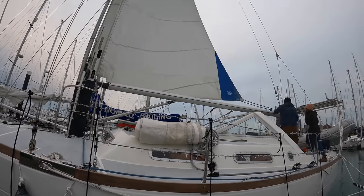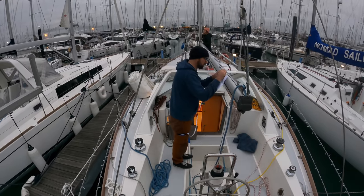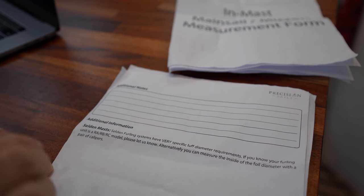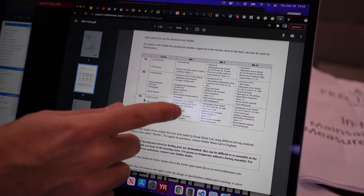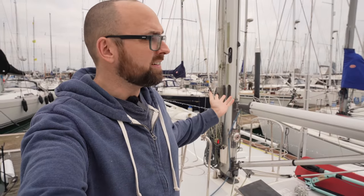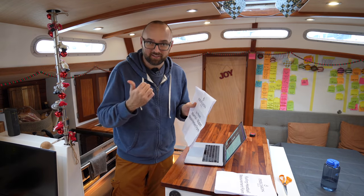The process for the mainsail was very similar. We unfurled it, took a few photos, then removed it and brought it up to the dry stack area to measure the luff, leech, and foot. Back on the boat there were only a couple more measurements needed. The Selden furling systems have very specific luff diameters, so I spent time trying to figure out exactly what mast I've got. I found a PDF from Selden that narrows it down — I've got either an RB or RC, based on the square locking tube and swinging tack attachment, but I'm not sure which. I've emailed Selden and included the luff tape measurement off the old sail in the form, so hopefully that'll be enough.